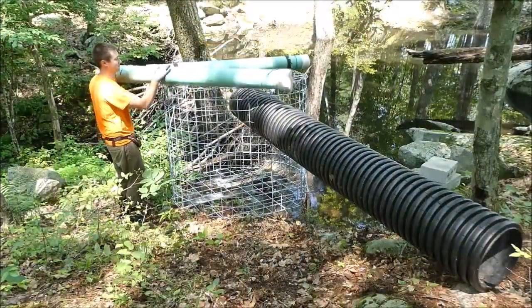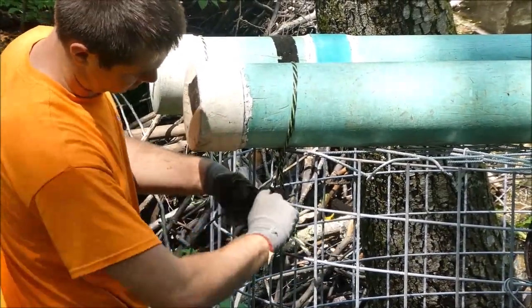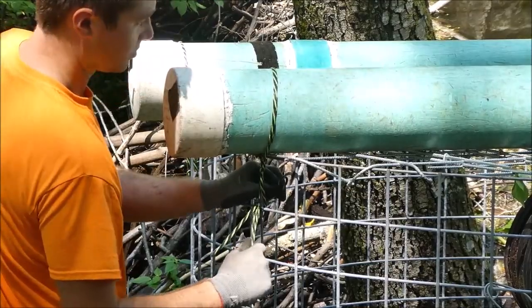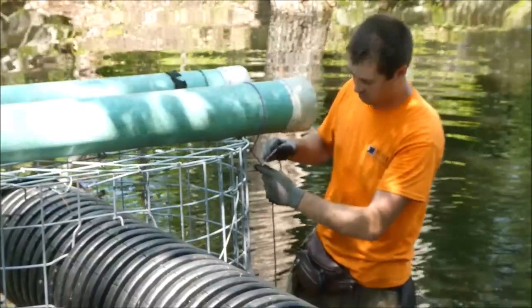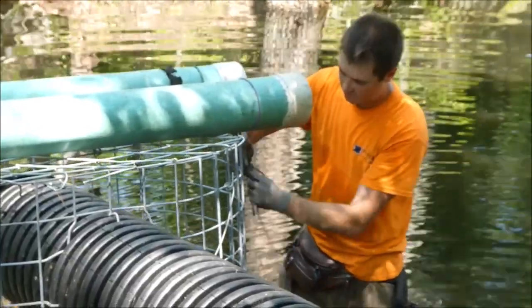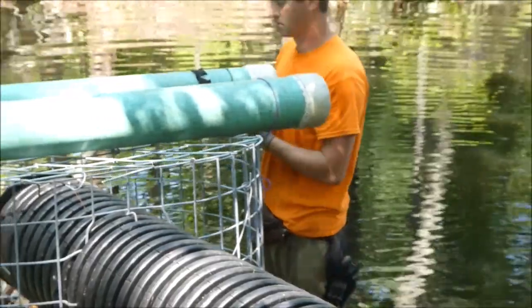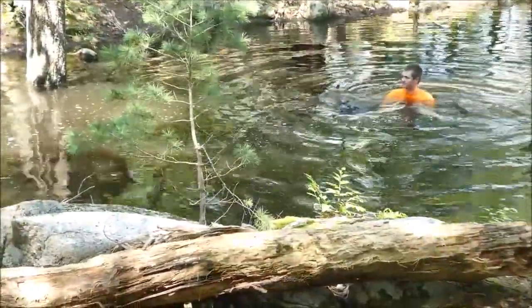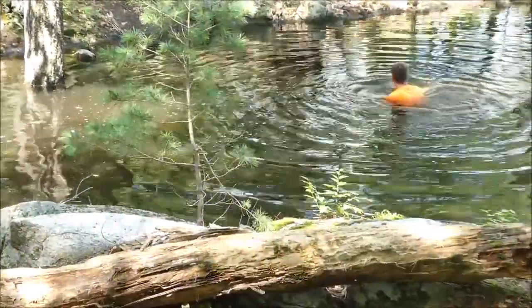With the intake fence still upside down and positioned next to the water, tie pontoons made from plastic pipe to the bottom of the intake fence, perpendicular to the pipe. When tying the pontoons to the side wall of the intake fence, use shoelace knots — it is very important that these knots can easily be undone with one pull when you are out in the water. Difficulty releasing the pontoons in deep water can result in your pond leveler sinking prematurely and landing on its side rather than in an upright position. Scout the area first, feeling with your feet if the water is deep, before you float your device out into the pond.